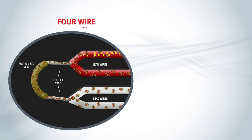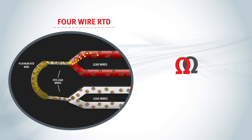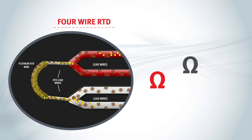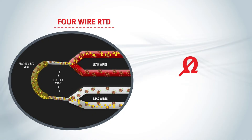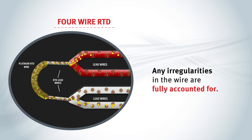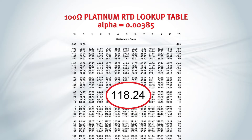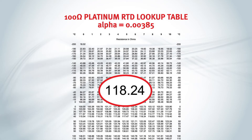The most accurate type is the four-wire RTD. This RTD compensates for both lead wires, such that any slight difference in the resistance of the two — such as slightly different lengths, nicks in the wire, etc. — are fully accounted for. As noted earlier, different metals have different resistance to current. The resistances of different metals at various temperatures have been established and recorded, such that valid interpretations can be made.